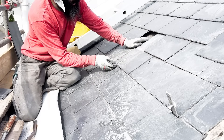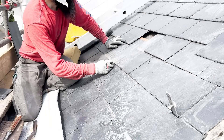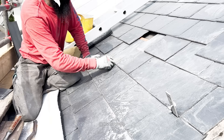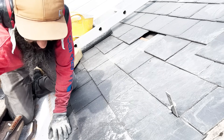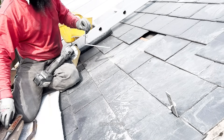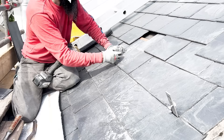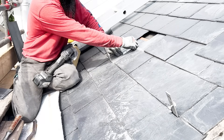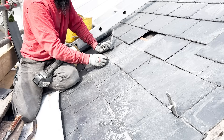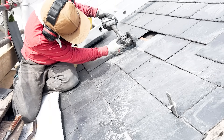You can see on the shirt there — I'm three stories up and it's about 30 degrees. It was near midsummer 2025 up on this roof and mighty hot. That's me reaching in there to feel the rafter or the spar coming down, marking it out, and trying to suss out where I need to cut. The bracket — here's what these look like at last — they're just an L hook but they're made out of stainless. They've got three holes in them; you really only need to fasten two of the holes according to the manual, but I guess it depends on what your roof looks like. If you've got a 10-inch or 12-inch slate, maybe it makes a difference.